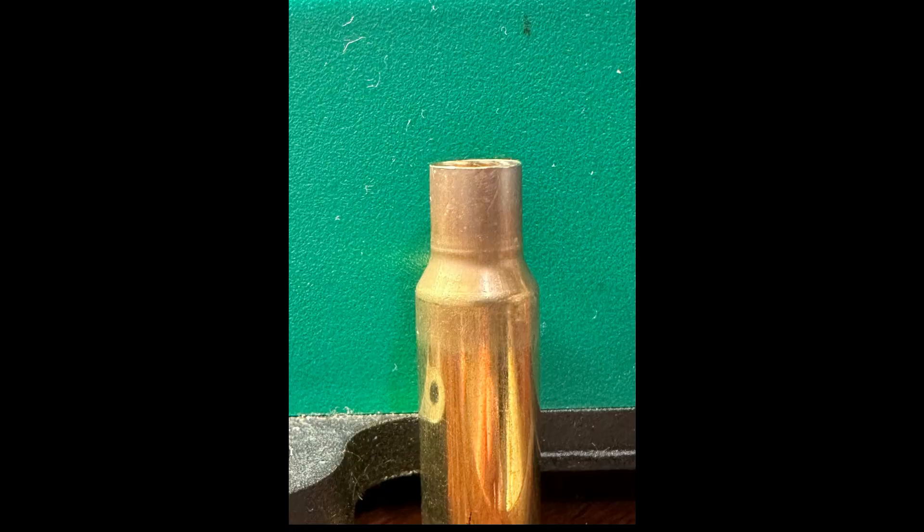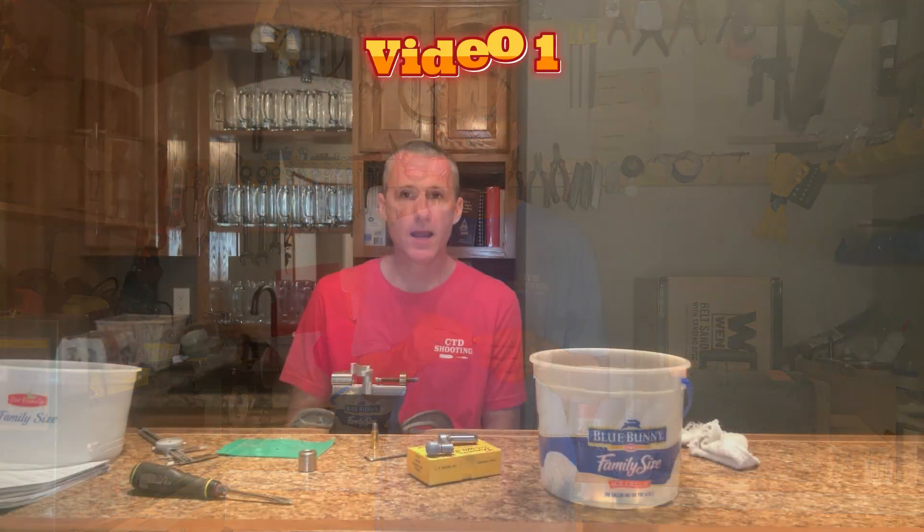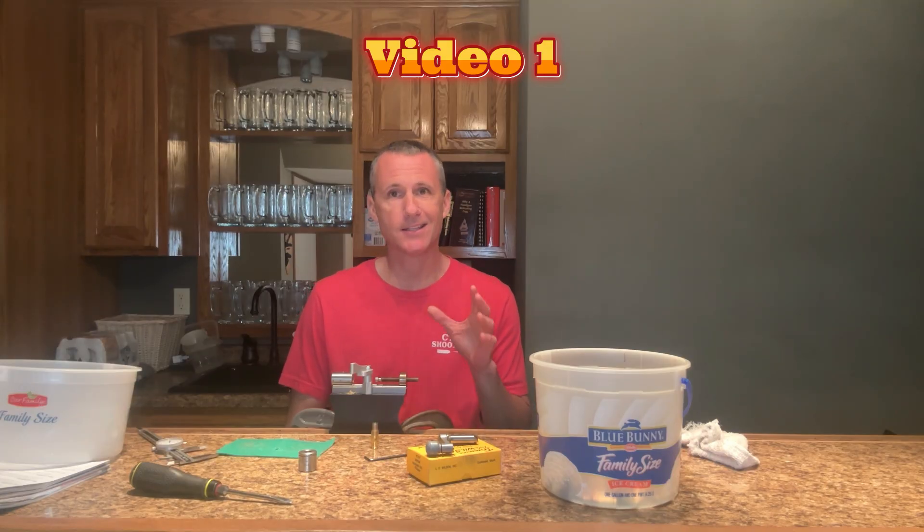This is another reason why I did phase two — inside neck reaming. When expanding from 6mm to .30 caliber, a donut is formed at the bottom of the neck. I use two turners when turning my 30BR brass. The first turner is set to just barely skim the neck but take that donut off, with the depth of cut stopping right at the neck-shoulder junction. If you are a neck turner, you cannot skip the trimming phase, because the depth of cut is determined by case neck length. When the mouth of the case hits the stop, the cutter can't go further — if your case necks are inconsistent, so will be the depth of your cut.